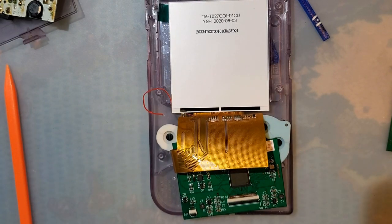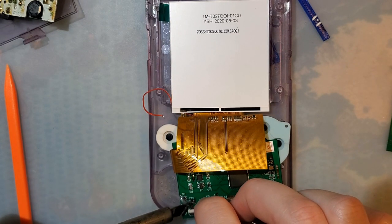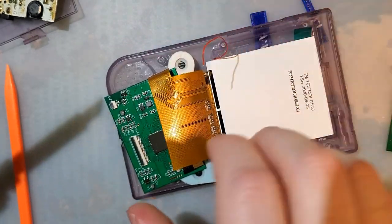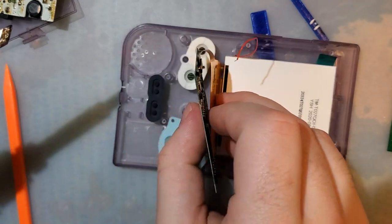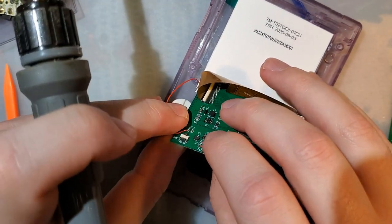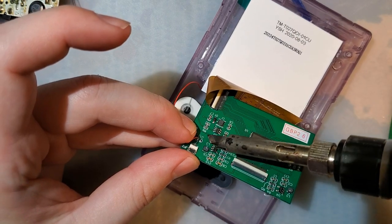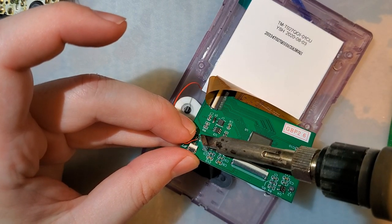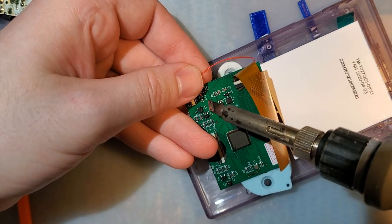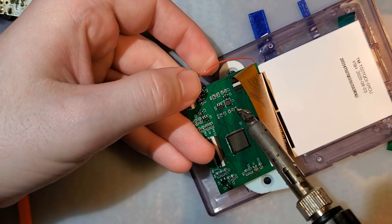Yeah, I was gonna say that's a sketchy joint. This kit doesn't have a dedicated pad to solder to. It just has that flat flex connector, and then an empty capacitor pad. And you solder it to the capacitor pad instead if you want to use your own touch sensor. But because this kit is wink wink nudge nudge solderless, they don't even give you the option, apparently, which I think is dumb as fuck.